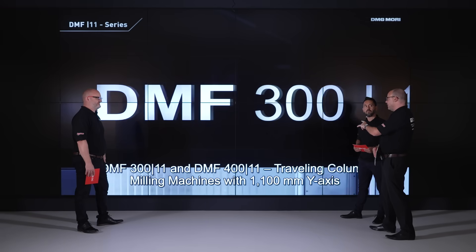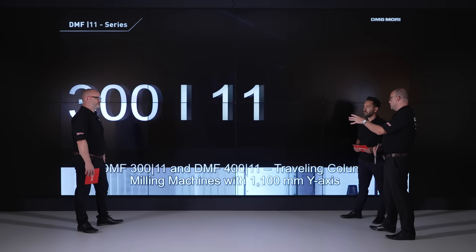Outside of the software, the hardware — a couple of points to mention. With a machine of such magnitude and size, holding tolerance and positioning — the thermal compensation — all the ball screws are chilled on this machine. You've got all of those features within the construction that allow you to keep the machine tight and able to machine from one end of the table to the other with really tight tolerances.